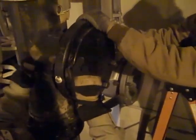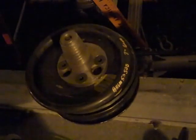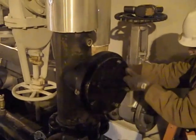Now we're installing the blind flanges — this is what the finished product will look like. They've already removed the completion plug holder, which is the piece that attaches to the drilling rig. This O-ring will get installed on the completion plug in the largest groove on the bottom and then get set in place. The blind flanges are the last step of the process.